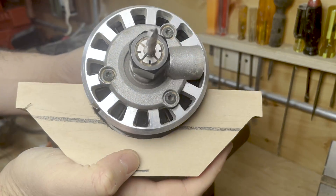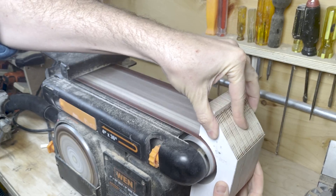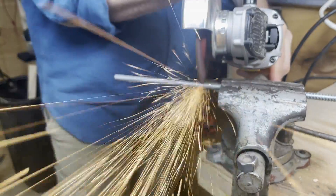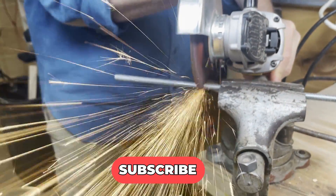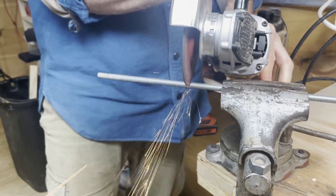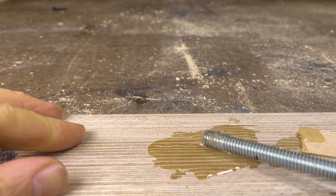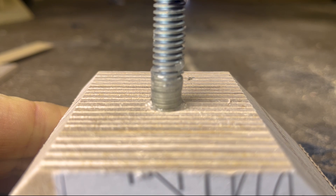Now it's just a matter of testing the fit of the router into the carriage, sanding it, smoothing out the edges, testing again, doing a little more sanding on the inside radius, and testing again until we get a good fit. Then I'll cut down some threaded rod that we can epoxy directly into those holes that were just tapped in the carriage. Watch this epoxy get wrapped around the threads of this rod and screwed into the tapped hole in the carriage of the router lift.